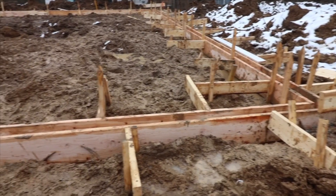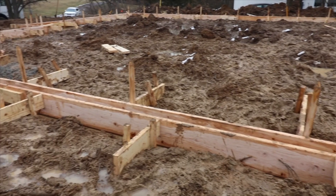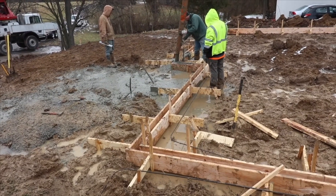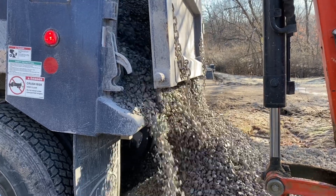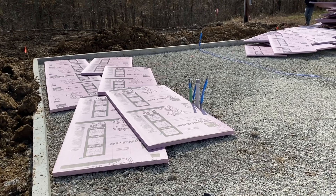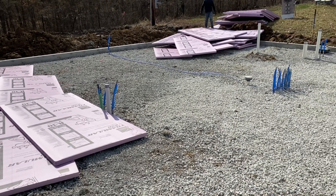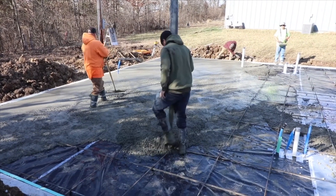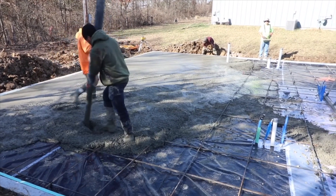It's one of the things that makes a slab-on-grade home more cost effective for the masses. In the traditional turn-down slab — as we call it — the next step is setting up form boards around the perimeter of the footing after they've dried, backfill with some gravel on the inside to cover the organic material that might remain, and then pour a slab on top of it — a four-inch concrete slab. It's pretty standard assembly in our market. I would say 99.9% of slab homes in our market are built in that exact same way.